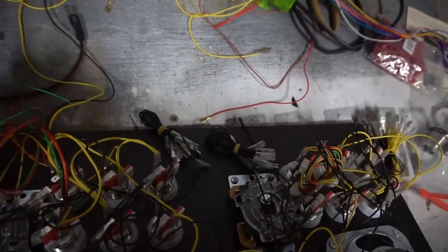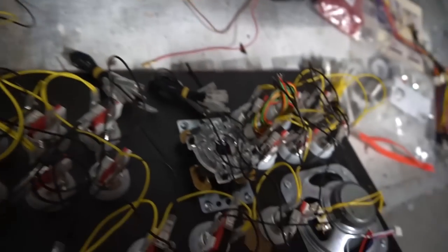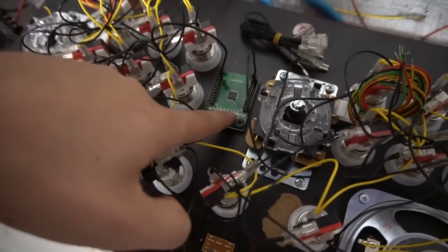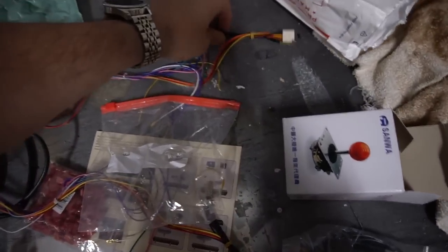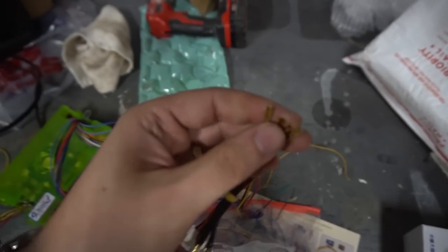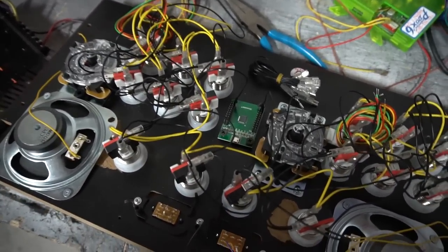As far as the controller, there are five wires — one is the ground and the rest are up, down, left, right. I'm tying the controller ground into one of these buttons to make it easier. We've got the Zinmo screwed in, and now we have player one and player two grounds. We still need to connect the Pandora's Box ground, so I'm going to cut one of these existing connections and loop it into a button rather than use those tiny atrocious factory connectors.